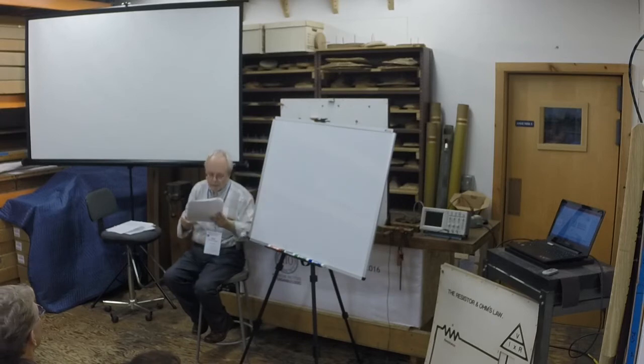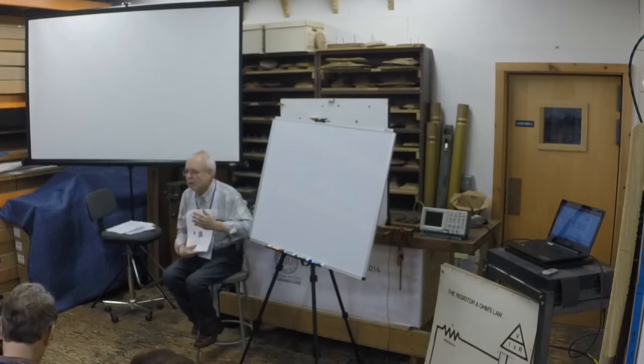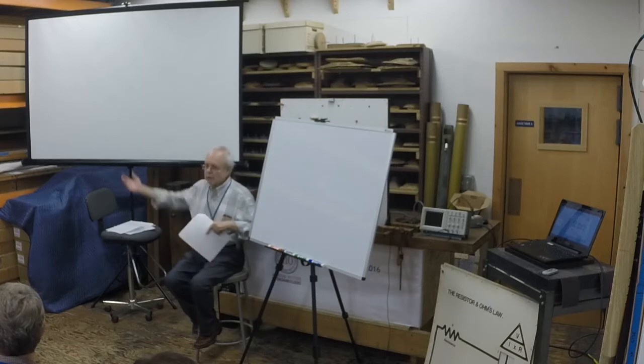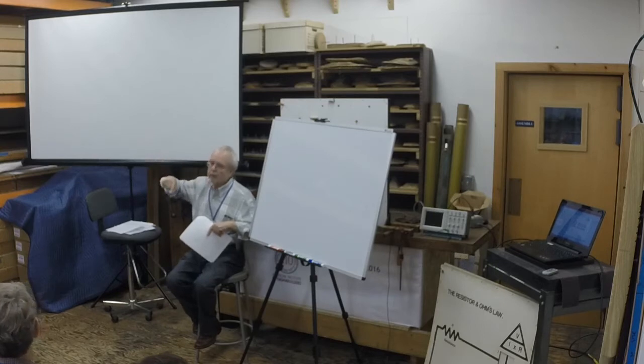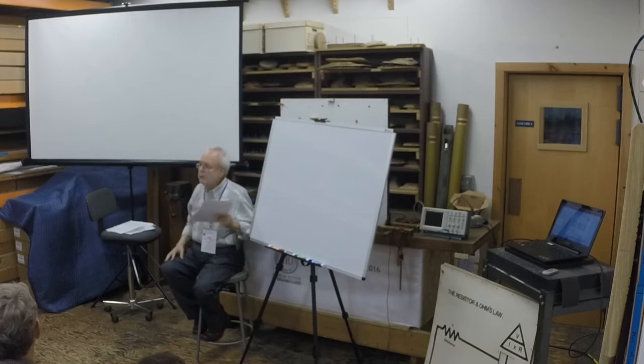In this nasty example here, it does say one useful thing. The resistance of the power cable will help to soften the link between power supplies and provide for better load sharing. This system is similar in the way that power systems work for AC feeds in our homes. Well, not in our homes, but the guy who wrote this is English. And they have something called mains ring. Mains being the main power coming into your house. Goes into the circuit breaker panel, and it comes out of the circuit breaker, and it goes to the living room, the dining room, the playpen, and then it goes back to the same point in circuit breaker, so it forms a loop.